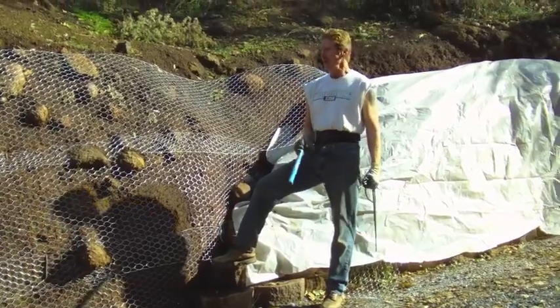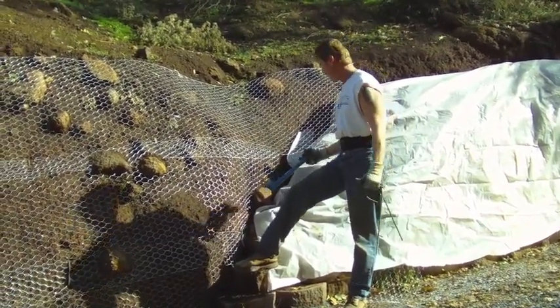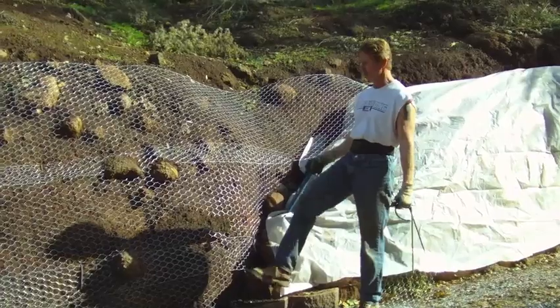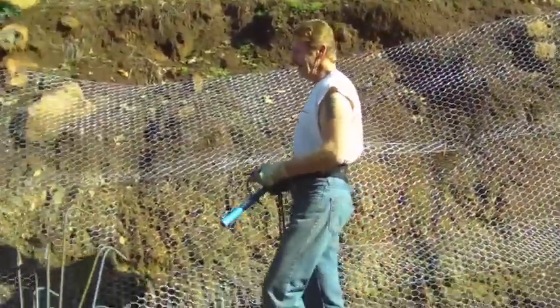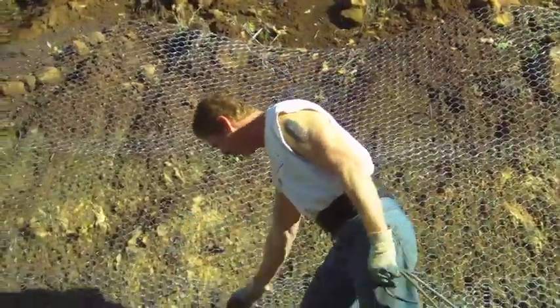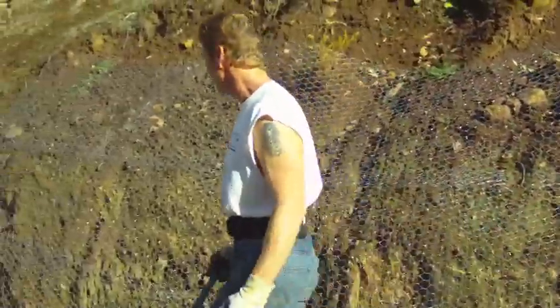I'm not going to show you three solid days of attaching wire because it's boring — it'll bore the crap out of you. What I will show you is what we're doing: we're taking this wire and pushing it in the back of the retainer wall rock. We're cutting out a lot of these rocks because I want them for looks as we come around. You've got to know how to improvise. We're taking this slope here so that the water will go down and I have to have the wire tied in — if we don't tie this wire in, we'll have cracks. Probably going to get some cracks anyway, even using common.